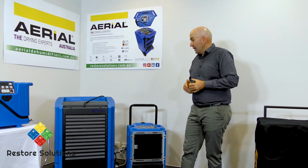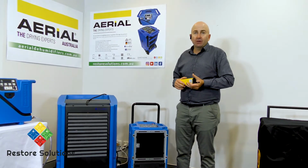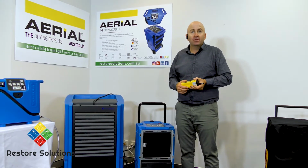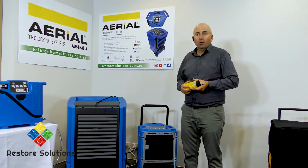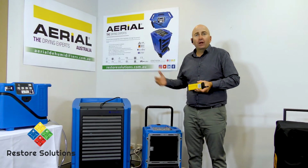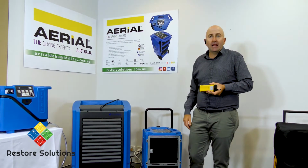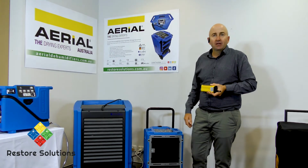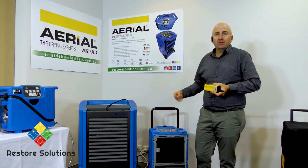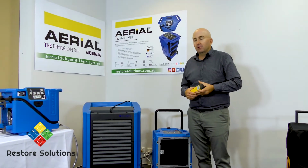A lot of the times, guys will have things on jobs where a lot of the dehumidifiers sold in Australia don't work under 19 degrees. Under 19 degrees, you just get wet, cold air coming out of it, because you've got to cool it down, and it might cool down about 18 degrees as it goes through. So if they've got a dehumidifier and it's going in at 18 degrees and it's cooling it down 18 degrees, the air coming out wants to be 0. So at the end of the day, sometimes it freezes up the coils and it's always in defrost mode. When it's always in defrost mode, you get wet, cold air coming out of the dehumidifier.